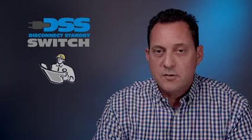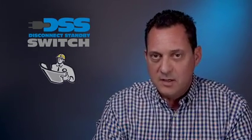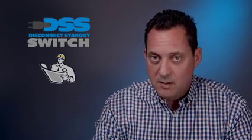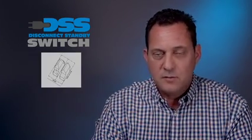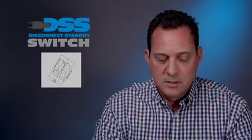Let's say you're a contractor bidding against a formidable contractor for a multi-zone installation. You're pretty close in price. You tell the customer, I'm going to make yours generator ready. That may be the tipping scale for the sale. Another great opportunity, zero lot line. Let's say customer zero lot line can't have a whole house generator. They have one of these switches for their mini split system. They can roll a generator around and run the AC system during power outages.